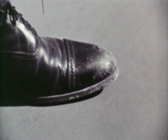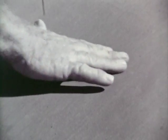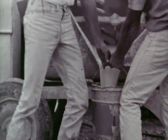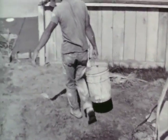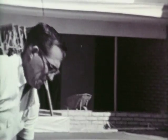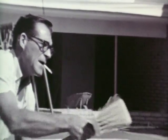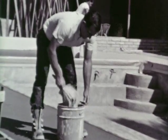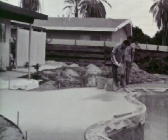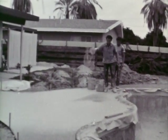Perfecting the timing of application. Watch for water rise, but no foot impression. Raise the brush high and move the hand forward, snapping back with the wrist. This is similar to cracking the whip. Dip brush into mix, covering full length of bristle. Start splashing. Rain on the mix in even, straight, side-by-side rows.